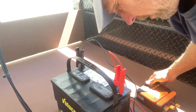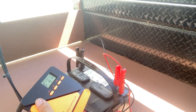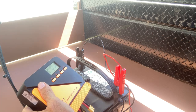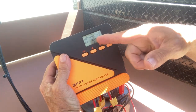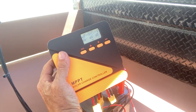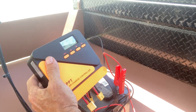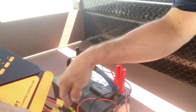Always hook up the battery to these first. She's hooked up — let's give it a second. It says we got a load, and the battery is 12.2 volts. There it goes right there: 12.2. Let's go ahead and hook up the solar now.